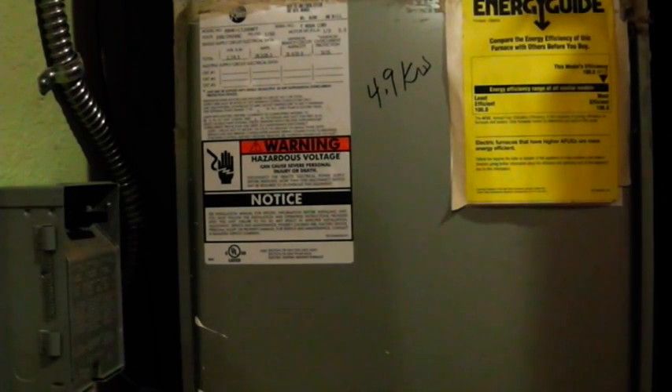Finally it dawned on me to ask the people how big their house was. They said 1,500-something square feet. I looked at the air conditioner — it was only a two-ton unit. I said for this type of construction it should be larger, like two-and-a-half or three ton, depending on insulation values. When you're having a home built they do a Manual J — an in-depth look at insulation of the walls, crawl space, R-factor of your ceiling, whether the home is wood, masonry, or foam. On this particular home, the AC was way undersized. The people were overjoyed to finally have an answer, because during the day it would get up to 85 degrees inside and never cool off until evening.